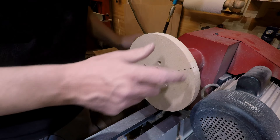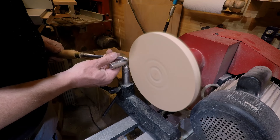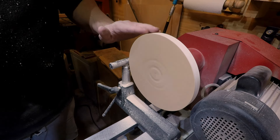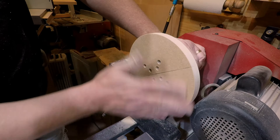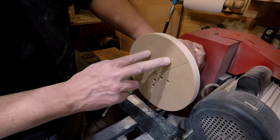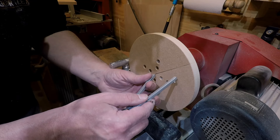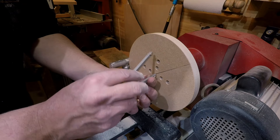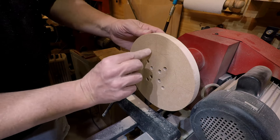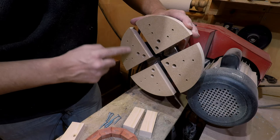It's a little bit out of balance, so I'm going to true up the outside edge now. That's now all trued up and ready for use. What I'll do next is put some screw holes on the outside — probably a couple on each side — so I can attach another piece of wood on top rather than having to ruin these every time. I should take these off again now and drill holes at this distance.